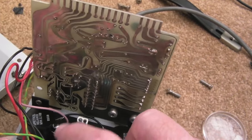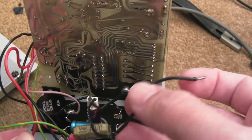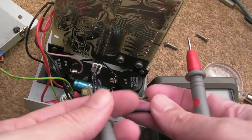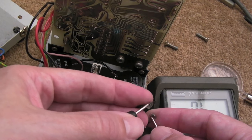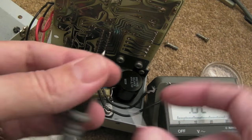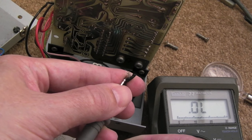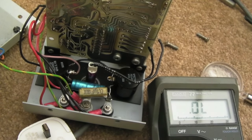I need to find a replacement for that cracked cap. The indicator I figured might just be a bulb — measured on my meter it's open circuit. I'm just wondering if it's an LED, so let me check. I've got my meter on continuity — trying both ways, nothing. So I think that's a bulb and I think it's blown. Let me see how it comes out — I'll investigate further.